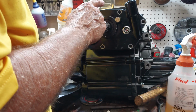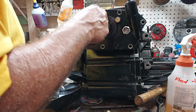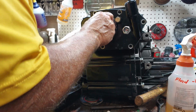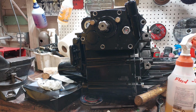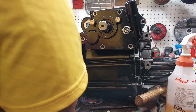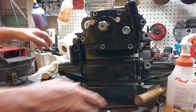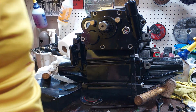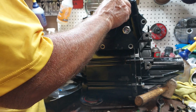Okay, so put the PTO shaft in the outside housing. You've got to put the bearing in first because you can't get the bearing in with the PTO bearing in there. Anyway, there's a way to do that. This I'm not so worried about. This is exposed to the environment generally, and when I say the environment, I mean the outside of the tractor. So if this doesn't go together very well and it leaks out of the bottom, I can take it apart.